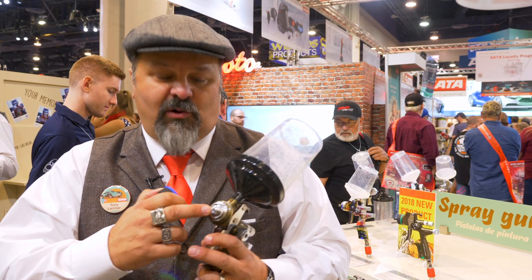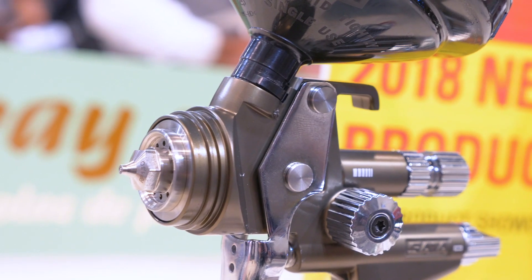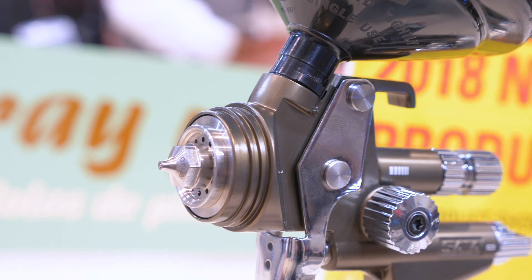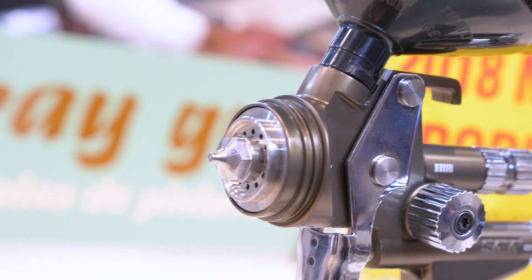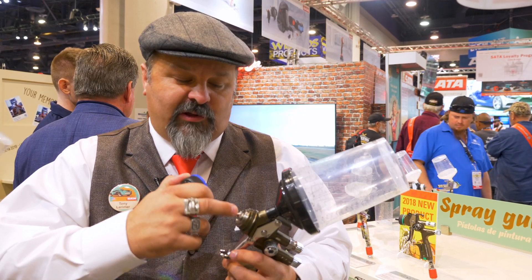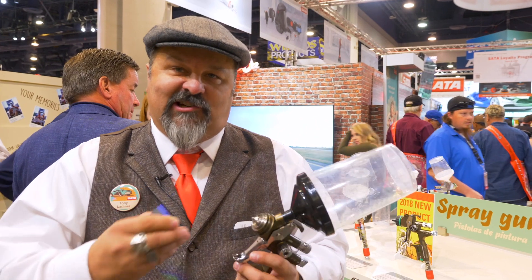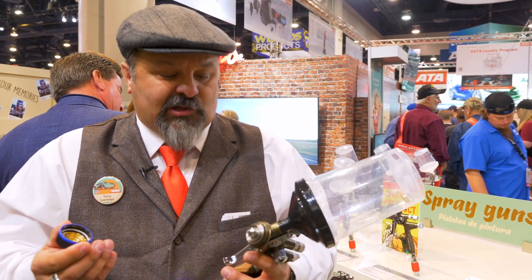What's nice is the fluid nozzle has changed drastically. Behind the fluid tip we now have no air distribution ring anymore, so we don't have that plastic air distribution ring to crush, clean, or worry about. The fluid tip seals with a seal at the rear of it down inside the body. The distribution ring is built into the gun body itself and into the backside of the fluid tip, where they seat together for a perfect seal.